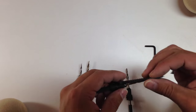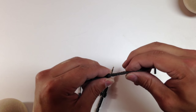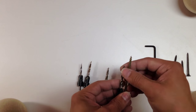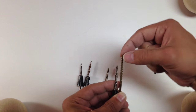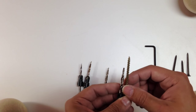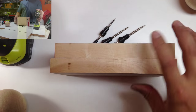This larger one is for a two and a half inch screw — it has a much thicker shank. For a three-inch screw, even bottomed out it'll be a little short, but when you're using a three-inch screw you do want it to grab well at the tip to pull two pieces of wood together — like for framing or thick material where you want a really tight joint.